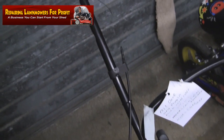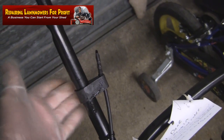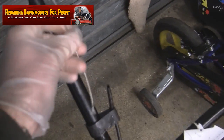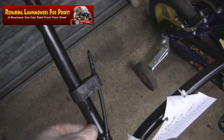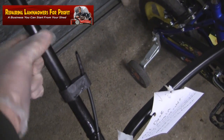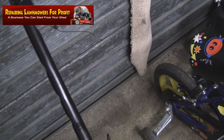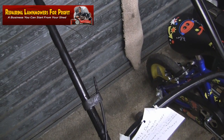The first thing I'll say before you replace your cable: if you're having problems with the drive, on the side of the SP470 there is a tensioner. If your cable is very slack, just move the tensioner down this bracket on the handle a little bit to tighten the cable up. That extra bit of tension might just be enough to get your drive working again — so definitely something to check and try before you replace the cable.